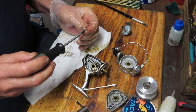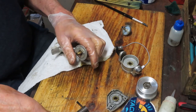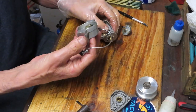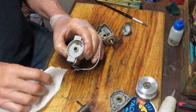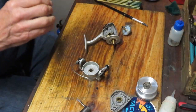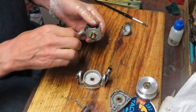I put parts into the tray to stay organized. There's some dirt in the bottom of this rotor, so let's take care of that. A little bit of penetrating oil acts as a degreaser and a sticky catch-all for dirt. I'm going to put oil onto the bail and work that through to make sure it works fine, and then we can reinstall the rotor.